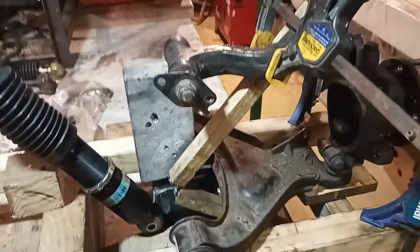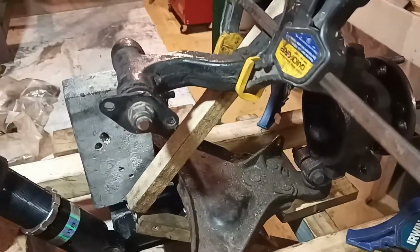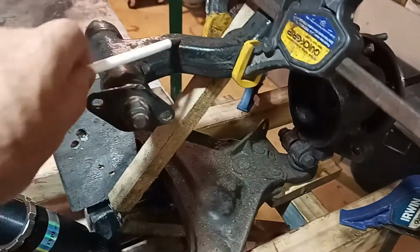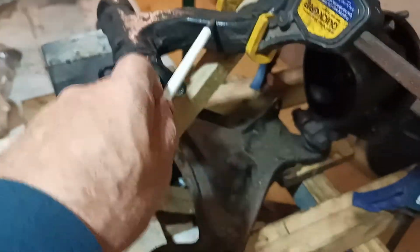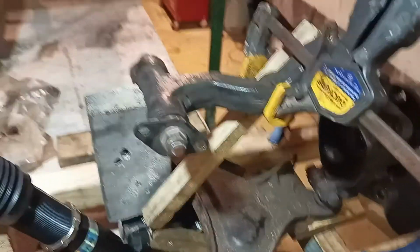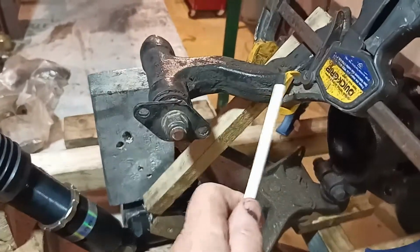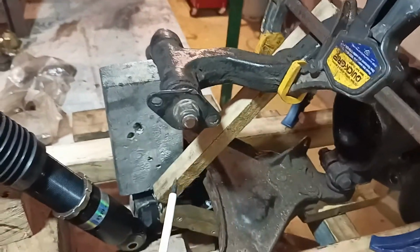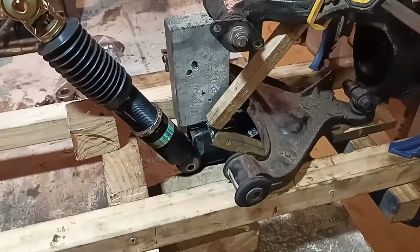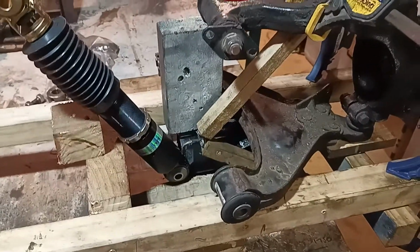The second reason is that because I'm using 10-inch wheels, I'm forced to use mini components, and minis suspend themselves from the top arm, and thus they have a top-loaded ball joint. That means that to get a low profile on the front of the car, I really need a pull rod so that the suspension loads are still taken through the top arm. And the third reason, well, the third reason is because it's fun. And if it wasn't fun, why would you bother building it?